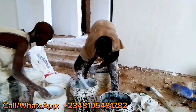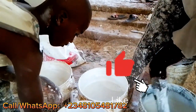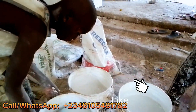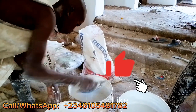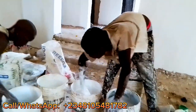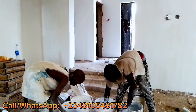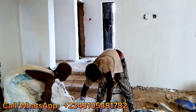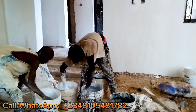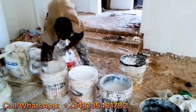So the quantity also. So we are putting it inside now. This is the chemical that makes sure the screeding holds on the wall, so that water will not just touch it and it will not turn to powder. Maybe after doing the screeding you touch it, it becomes powder. This is the chemical that makes sure it does not happen. Again, about the quantity, you can get it in the course in the description.